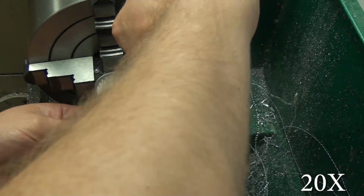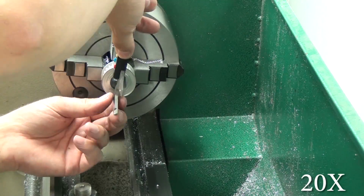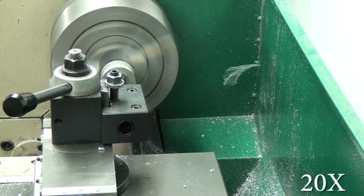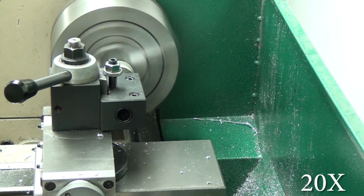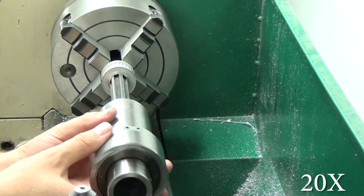I think I had to bore this out to 851 thousandths, something like that. I got close, then brought the spindle over and kept sneaking up on it until the splines went in and I had a nice snug fit. I don't think I wrote down what the number ended up being. I was trying to hit 851, but I can't remember.